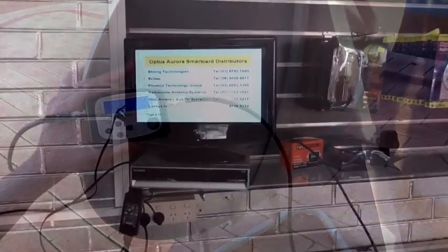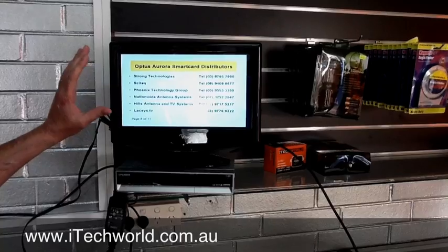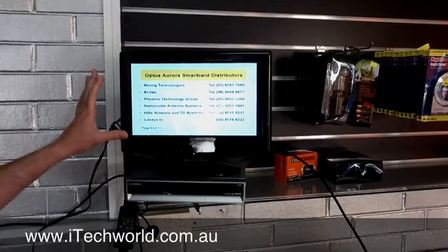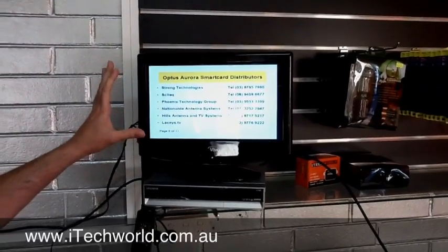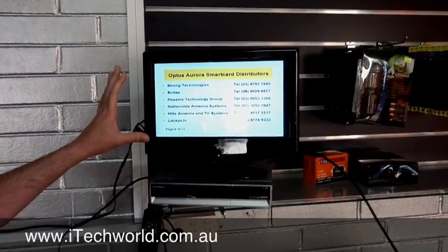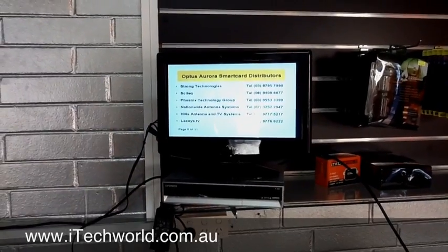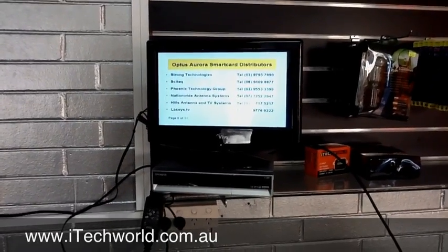And that's pretty much it. As you can see here, this shows we're on the left, on the Optus C1 satellite. So, we've tuned the satellite dish in perfectly. And I haven't even really looked at the compass to get the correct bearing — I've relied predominantly on that satellite meter, which is extremely sensitive. The first couple of times might be a little bit hard to use, but as you use it you become very fast at it. And that's it — we're on the C1 satellite and the satellite dish is specifically tuned into that. I'll see you next time.